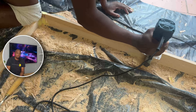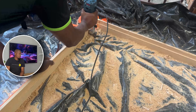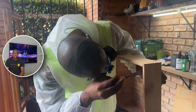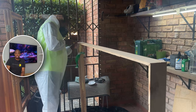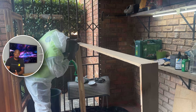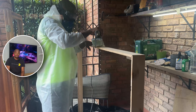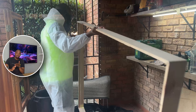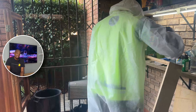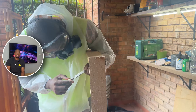Once the routing was done, the next thing you do is cleanup — removing all of the tape and then starting the sanding process just to make it smooth to the touch. I'm going to leave it as raw wood, not oil it or anything, so it needs to be smooth, splinter-free, and nice to look at.